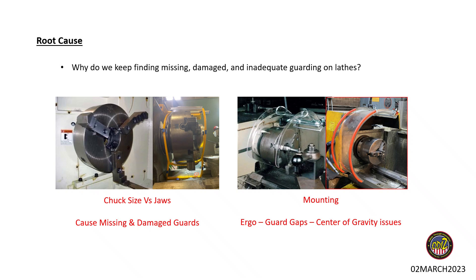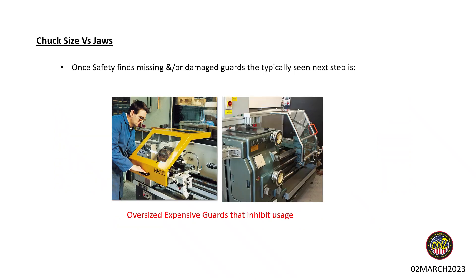We also see issues with how to mount the guard — it could be a back mount, flush mount, or top mount. That angle on where you mount the crossbar creates ergonomic and center of gravity issues with the guard. We get a lot of complaints where operators lift the guard up and it comes back down and hits them in the head or the arm. That's due to the guard design not matching the operation and causing center of gravity problems.